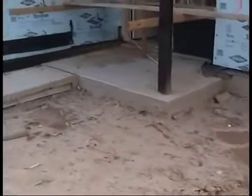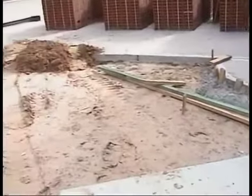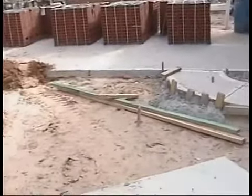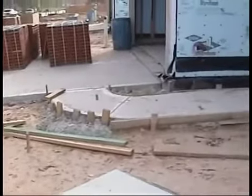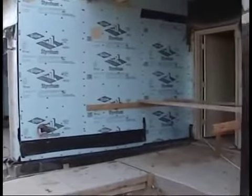The issue usually is in the front yard. As you can see here, there's a good slope, certainly more than 6 inches in the first 10 feet, so water will definitely drain away in the front. However, we've got to walk the sides as well, make sure there's a swale there, or will be if there's a house next to us. And also what we've got to do is make sure that there's proper drainage in the backyard. Usually the issue comes up in the backyards.